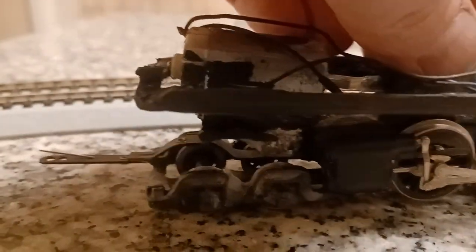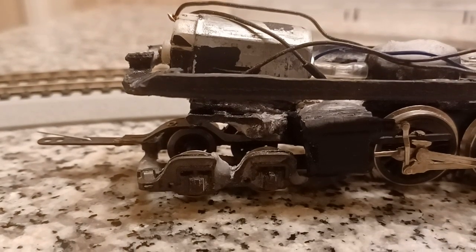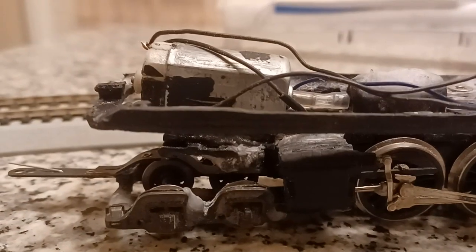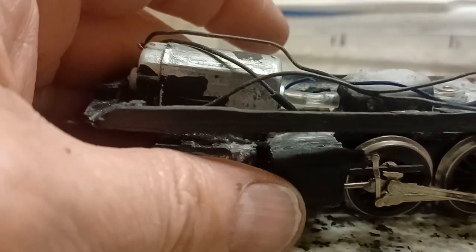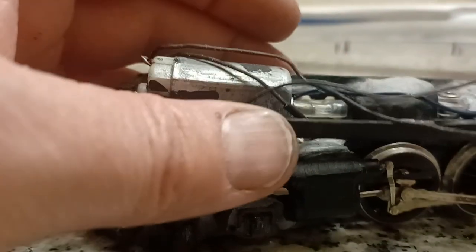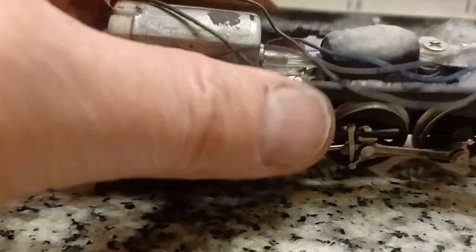When I take this cover off and flip-flop it so it fits on the frame, and then change the worm gear so I can have it facing the opposite direction, I have this problem. So anyway, like I said, I spaced it. It got rid of most of the drag. And I knew there was drag because when I loosened the screw up, the wheels picked up speed, and when I tightened it back down, it slowed down. So I know it had the problem that the other 2 trains had. It's something I'm going to work on. But anyway, so, to the front truck.